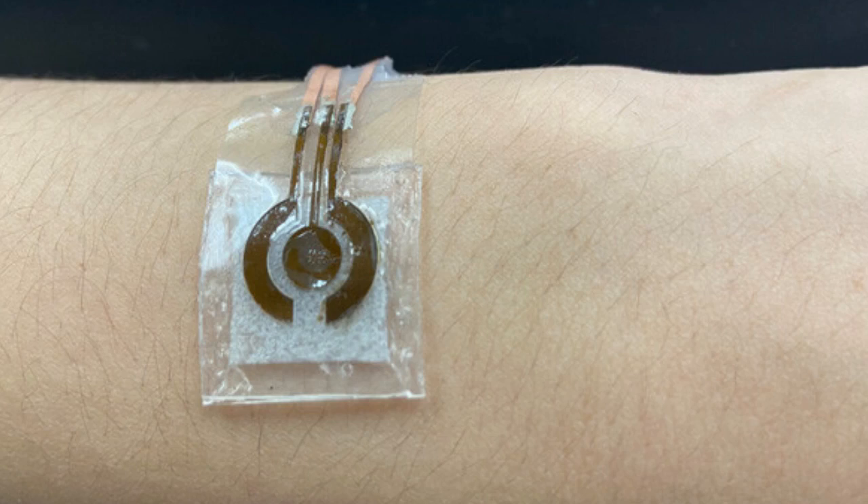Non-enzymatic sensors require an alkaline solution, which can damage the skin and typically limits device wearability. To curb this issue, the team attached a microfluidic chamber to the LIG alloy. This chamber is smaller than previously developed configurations to promote wearability and porous to allow for a range of movement, such as stretching or crushing. It is connected to a collection inlet that passes sweat into the solution without allowing the solution to touch the skin.